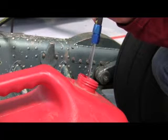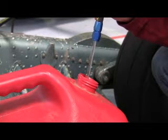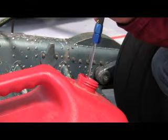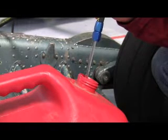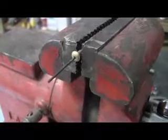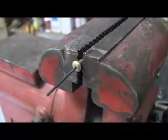Here are some thoughts on plumbing your aircraft right to the generator. If you end up with any leaks, it could be pretty catastrophic, so I've figured out a way to mitigate that issue. Here's the fuel flow with gravity feed and static pressure through a quarter-inch line — this is flowing about a gallon a minute. The Honda generator at max load consumes about a gallon every four hours. So with a flow of a gallon a minute through a quarter-inch line, that's quite a bit. Here's what you can do to make a restrictor: you need an AD rivet number 5.